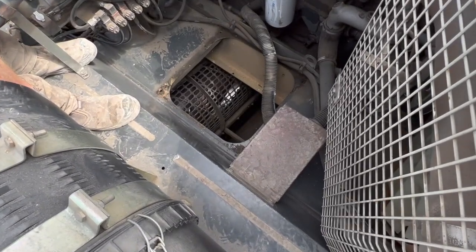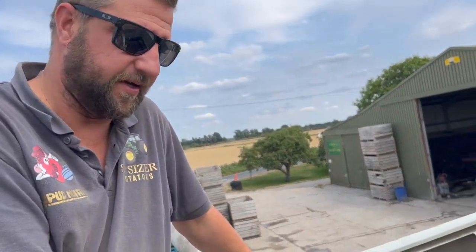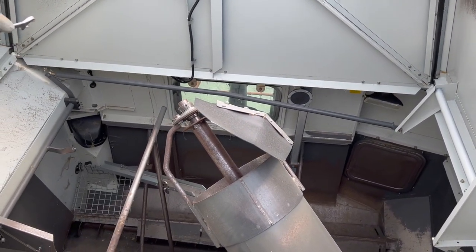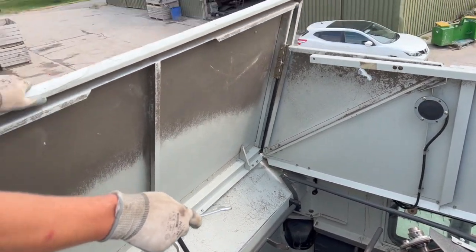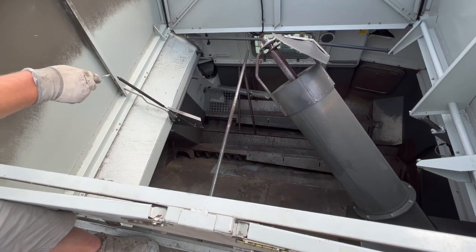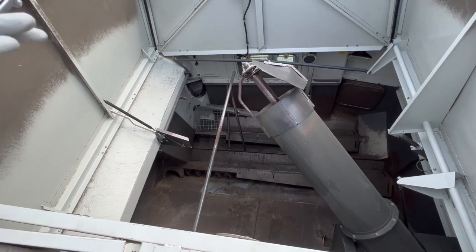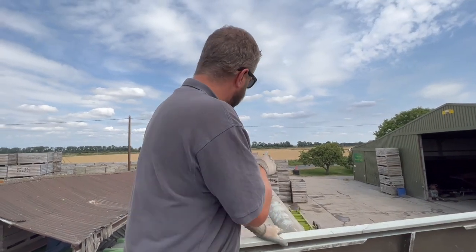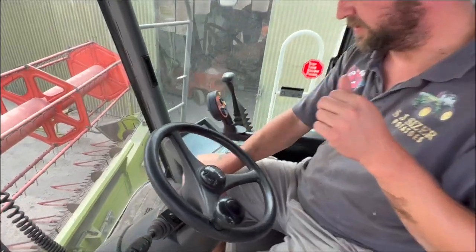So there are the rotors, and you can see the grain tank underneath. The auger down there comes up from the grain tank — there's another auger there that fills the top of the combine. I've got two sensors — I've got a window so I can see what the sample's like, and another chute that will shoot it straight down into my hand. Two sensors tell me when I'm 70% full and when I'm 100% full. I moved them up last year to get a bit more capacity but then Grumpy Granddad was saying I was overflowing. The two unloading augers that shoot it out the side weren't timed up properly — they're supposed to go alternate, one then the other, but they were both going at the same time, so it unloaded at a hell of a rate but poor old Grumpy Granddad couldn't keep up with the trailer. Once we figured that out it comes out at a more respectable pace, out of the unloading auger and into Granddad's trailer.